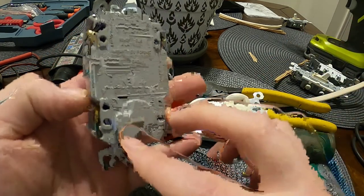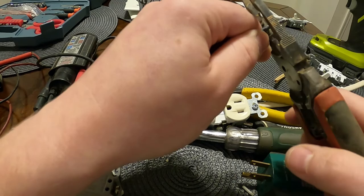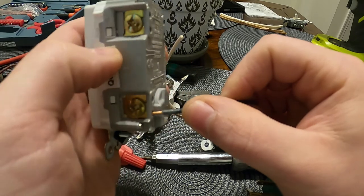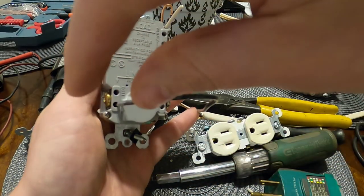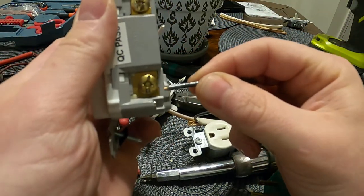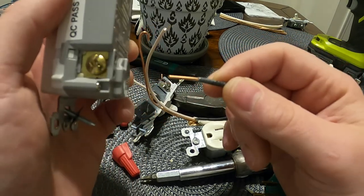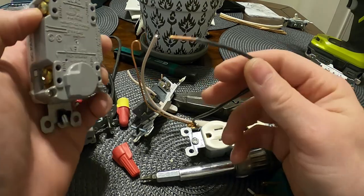You can have multiple things put on the line side — and this is a time when you are allowed to backstab; it's okay here on GFIs. You'll have a stripped end like this — you don't curl it on GFIs. If you only have one wire, I always suggest going in the bottom hole, and then tighten it down just like normal. It sandwiches the wire in there between the screw and a block they put in there. Tug on it to make sure it's tight. Make sure when you strip these that you don't have too much copper showing out the back — a little bit is okay, but too much can cause arcs and shorts in the box.